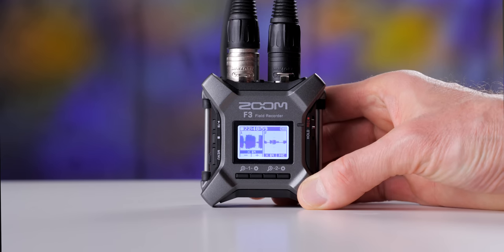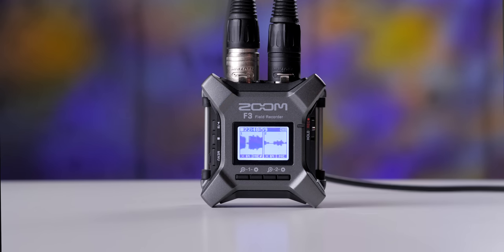It's not changing how much the analog preamplifier is amplifying the audio signal coming out of the microphone. Instead, it has a hard-set gain setting that's optimal for this preamplifier, and then it records into 32-bit float. It has two analog-to-digital converters — one takes care of the loud sounds, one takes care of the quieter sounds. It combines them together, and between the two, it's able to capture a very wide dynamic range — really loud and really soft sounds all in a single file.